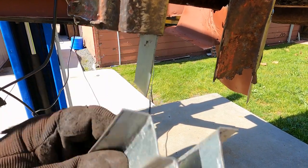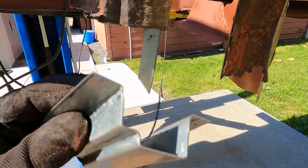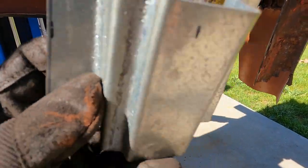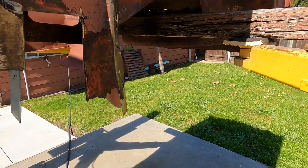That way it gives me good alignment on the post because this is stable — it's all where it should be. So that'll line this up and I'll have a lot more surface area to join this, because every time the door opens and closes it's trying to do that to the post. So I'm going to get the spot welder and we'll spot weld this.